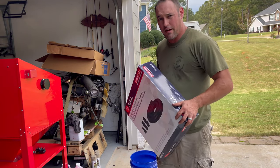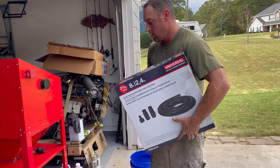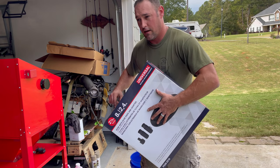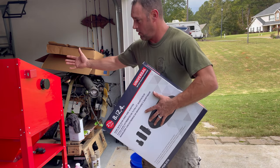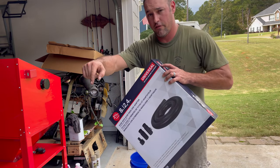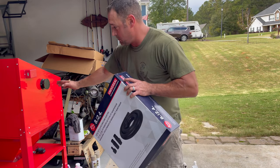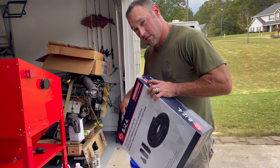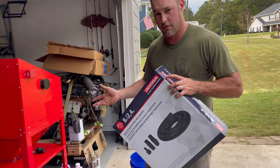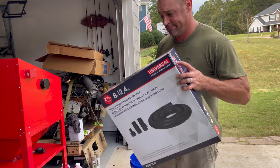All right, guys, so I just got back recently from going out and getting some of this stuff. And guess what? This is gonna be a hose for this bucket right here, and this bucket is gonna be a cyclone. I've been looking this up online for all the dust that happens once you start sandblasting. Basically, you turn on a shop vac, which is connected to the lid of this bucket, which has a hole in the side where a hose comes out, which makes a cyclone inside the bucket, and not so much crap goes into the shop vac, which clogs the filter. I've seen it online, and it looks to be working really well. Let's give it a try.